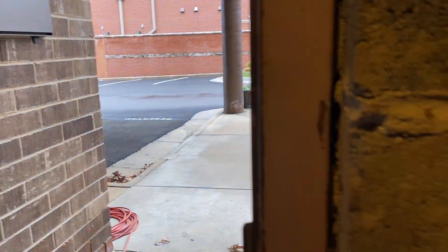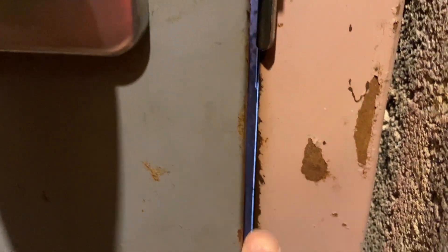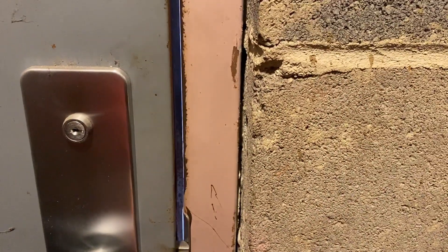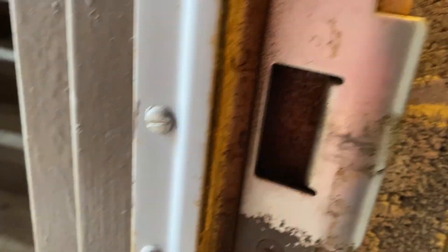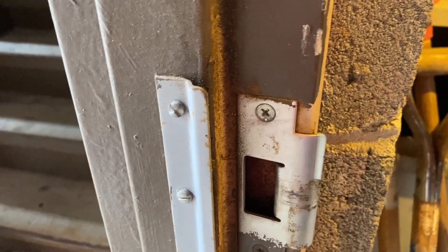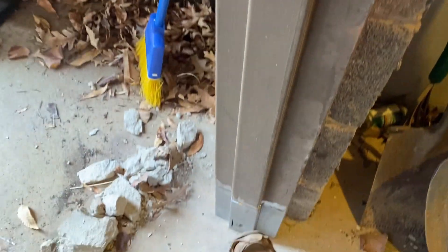When I go inside and close the door, I discover that the gap is a little tight right here. On further investigation, the jamb is not solid, so I'm going to drill right through and put one of these concrete anchors in there to hold the top part of the jamb in place. I'll weld the bottom and put another anchor down here as well to hold it.